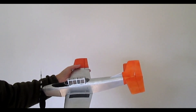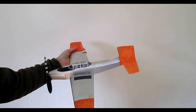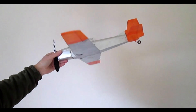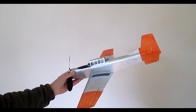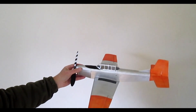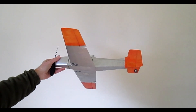A good feature of these ailerons is that if I hold one aileron right up, I can flick the other aileron right up with no ill effects whatsoever. This has proven really useful because even in long grass the model will land and often both ailerons will be pushed up by grass. If the model lands in a tree or one wing slams down on a stone, it will get away with it. Earlier systems I made were more rigid and things would break.